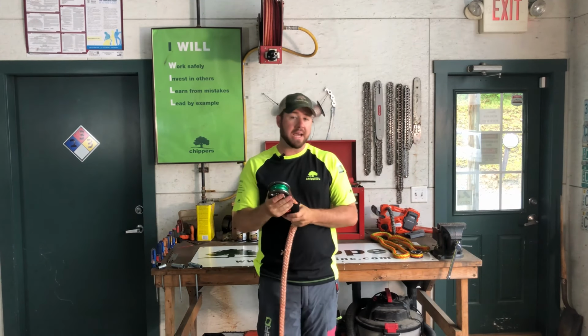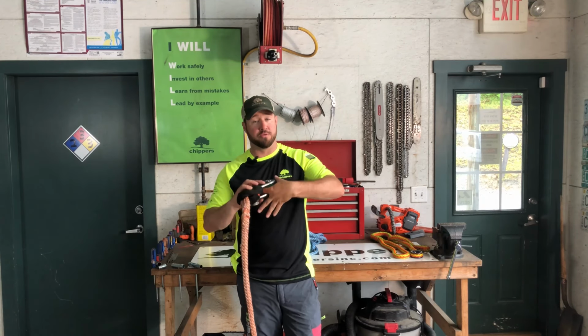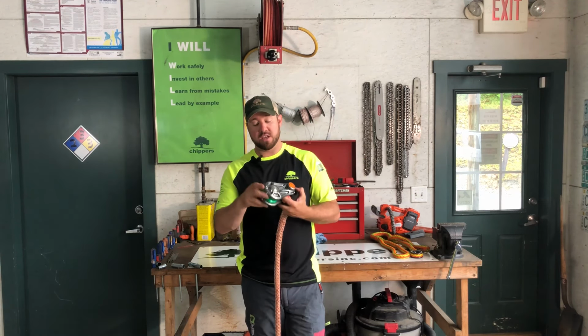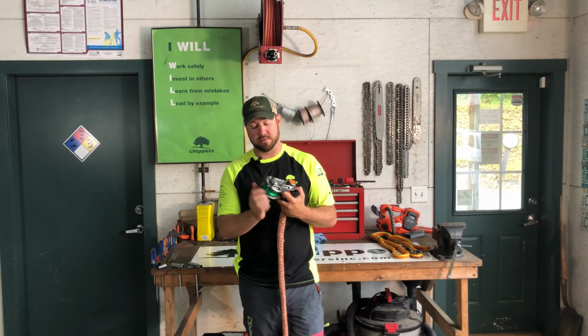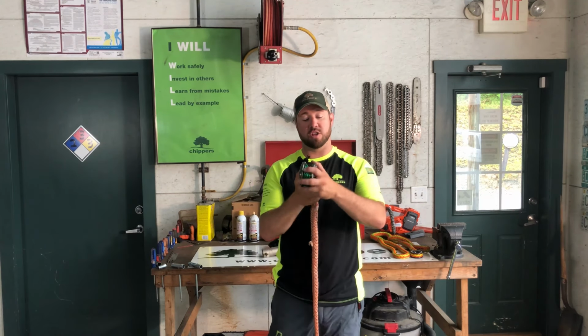Biggest difference between an impact block or a rigging block and a ring is the block allows the rope to move. So you're not actually gaining that friction that you're gaining with the rigging rings that's worth about a half a wrap. You're actually lowering the amount of friction by having a movable pulley in place, a sheave here. All right? A lot of people misconstrue these as pulleys, and they're not. They're impact blocks because they have rounded edges all the way around.